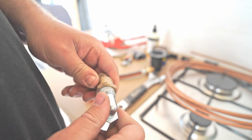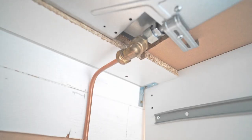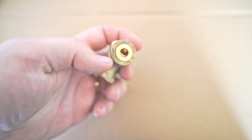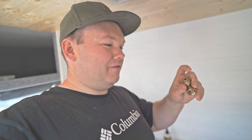The connection to the hob itself goes through a brass elbow — this one is actually a 15mm connection — but you buy a thing called a reducing set that goes in the compression fitting of the elbow. I use two elbows just to route my copper pipe out from behind the kitchen cabinet easily. Again you need to use a copper olive in it, as it will come with a brass olive. When I was doing my research on the first van I did, it took me forever to find this tiny little fitting, but a plumbers merchant recommended I use it.